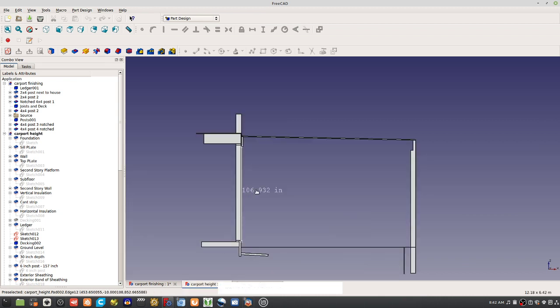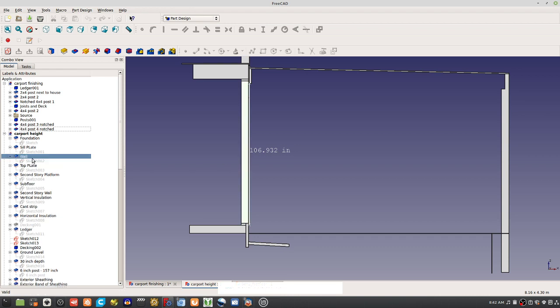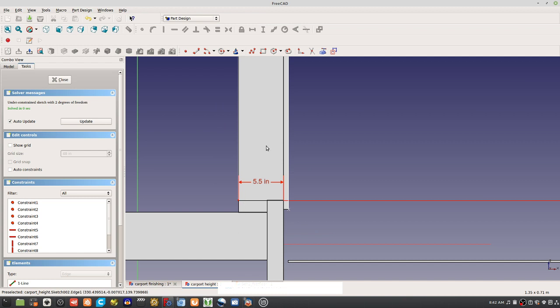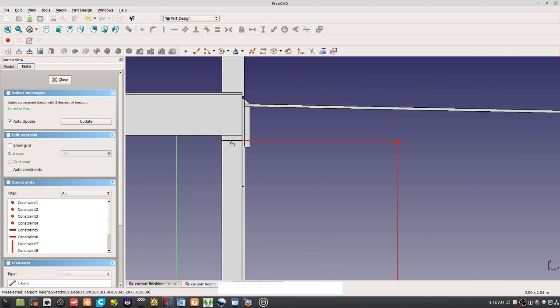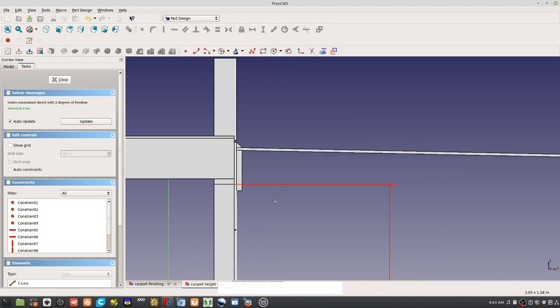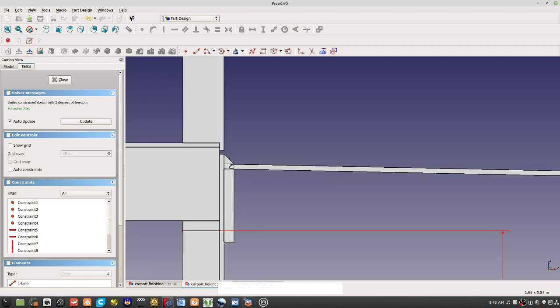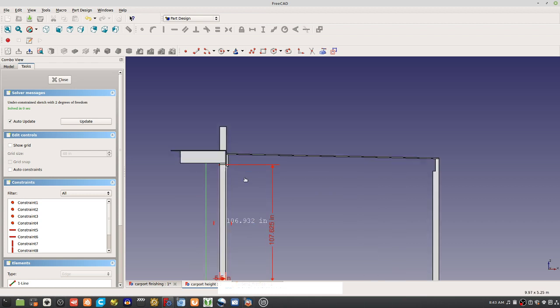And how did I draw it up? Well, I just started by doing a simple document, using all the known heights. For example, we know this is 107.625 for the wall module. You've got a bottom plate, you've got the foundation. You've got all the known quantities here. That's the top plate that we've seen, that's the second story platform, that's the OSB. And when I drew this against the known quantities in FreeCAD, I had this detail here, using this exact size,